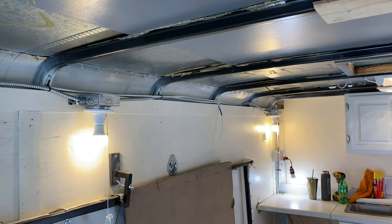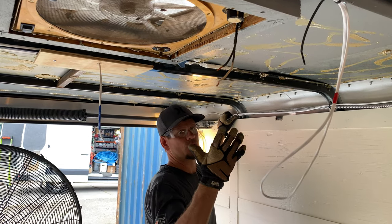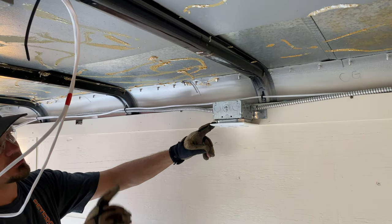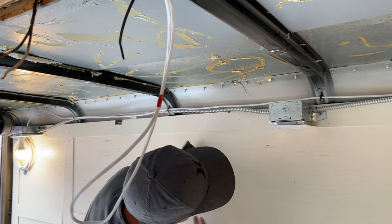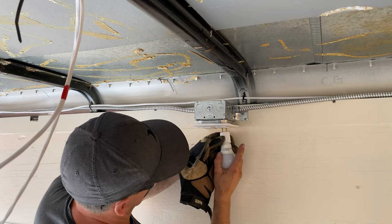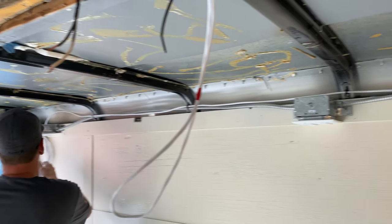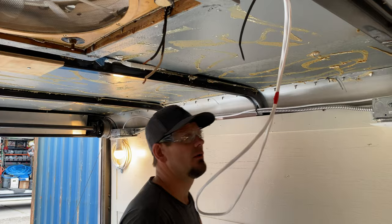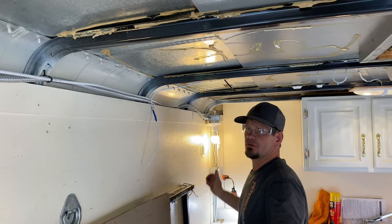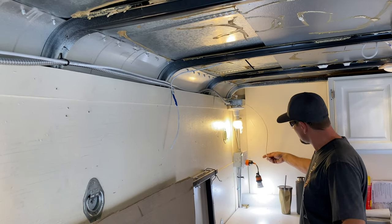It's a four-wire — a black, red, white, blue, and green, so plus green is a five-wire coming this way. We had a black wire doing the lights coming backwards on the blue for the switch lead, and the neutral ties through. We got two circuits. Right here I have a circuit that's GFCI protected — its own dedicated circuit for these three outlets. The other one's a black circuit. I only have four circuits that are 110 in this RV. He can turn these off individually if he doesn't want them on at night. The coax comes back over here from the satellite to go to his TV.